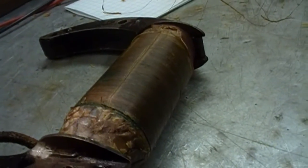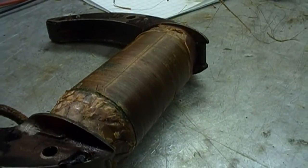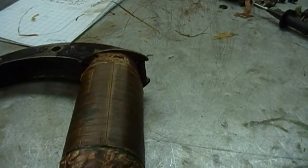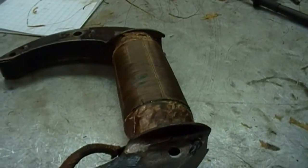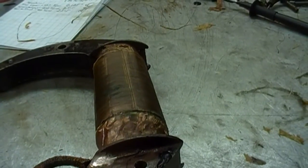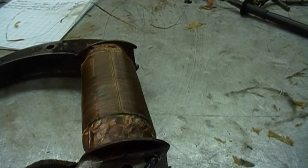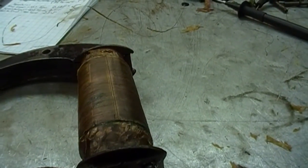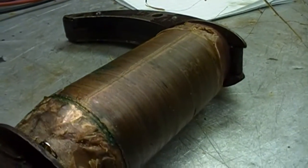I'm not going to be able to get by with just taking off a few coils. I think I said at the beginning of the video there were maybe six total wraps, but it's probably closer to 10 looking at the thickness of it. So about 400 turns per wrapping — 4,000 turns of wire for the entire secondary is what I'm predicting. I'm still looking for continuity if I find it, but it's going to be a hard decision just to splice and redo a few turns of secondary instead of redoing the whole thing, looking at how deep into the winding we are and how bad the corrosion still is.